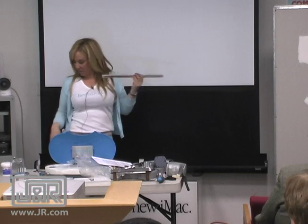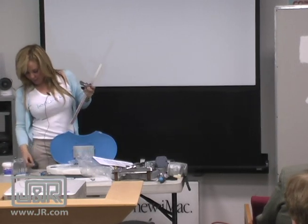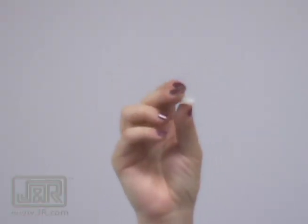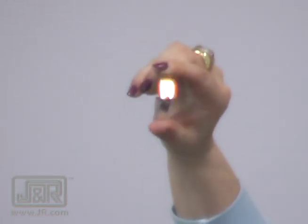Perfect. There's these great towel bars, and we can try and put this up. But these are like little plastic anchors. These shields right here act as a support in the wall. When it gets screwed into this, it acts as like a reinforcement. These right here are really, really neat. These go into the wall and they expand when you put them in and they lock in the screw.